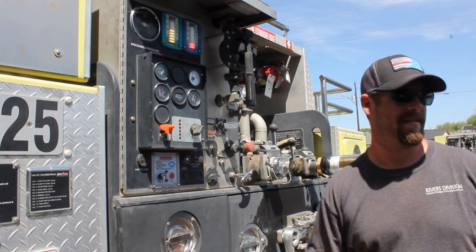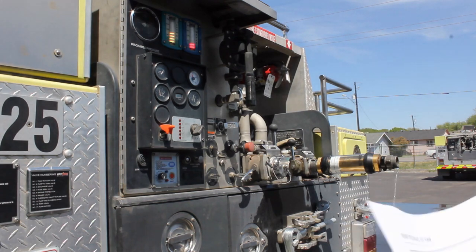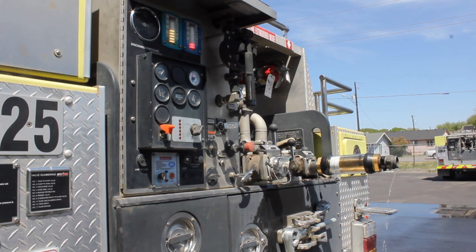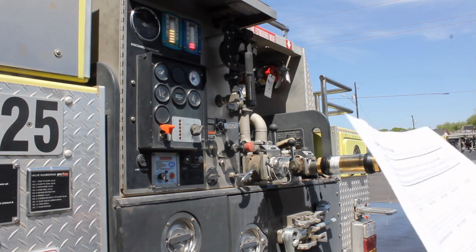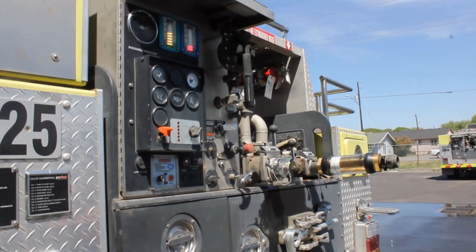Okay, so the last pieces there were free flow at max RPM. That's where we cranked it all the way up as fast as it'll turn, and we measured what it would flow at, right? And then open the valve all the way. We measured that max flow, unrestricted, and we still got 114. We had 114 at 100 PSI. We had 114 at 50 PSI. That's not bad. That's actually fairly normal. That's about the top end of the performance curve today.